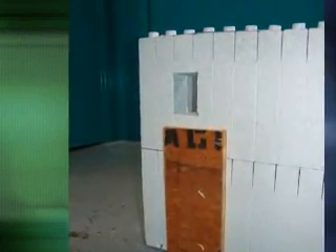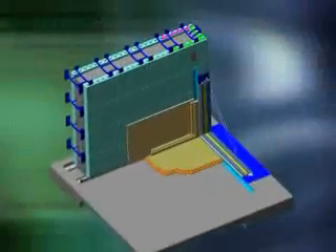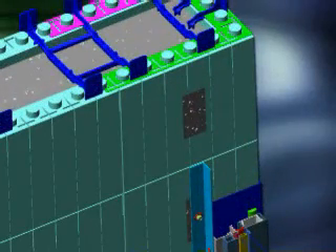If direct attachment to concrete is desired, form the rough opening with panel scraps as described previously, but cut holes 4 inches by 4 inches wide in each panel layer to bring the concrete out to the face of the foam. Line the opening with forming plywood and brace. When plywood forms are removed, there will be a concrete surface every 12 inches to attach windows or window stops.